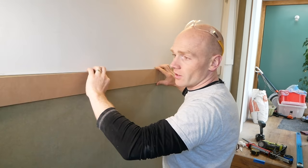And the panels might be slightly off, but they'll be even along each wall, and the eye sees that in a better way, rather than trying to carry it around and then end up with a small panel as an infill right at the end in one corner. Now I've got at least one more coat to go on here.